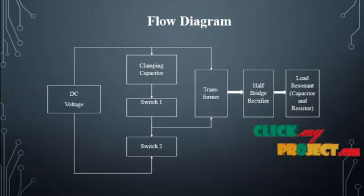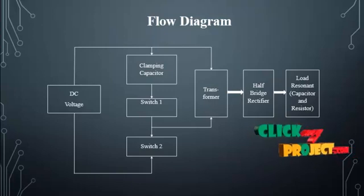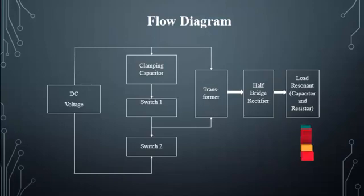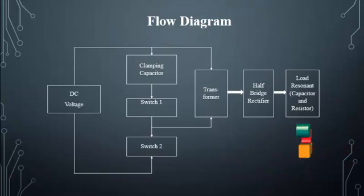Switch 1 and switch 2 run based on the controller signal. In our process, the pulse width modulation acts as the controller of the process. The output from the pulse width modulation can be divided into two paths of pulse waveform. They can be used for the mux operation, Dmux, to split the two input signals from the pulse width modulation.